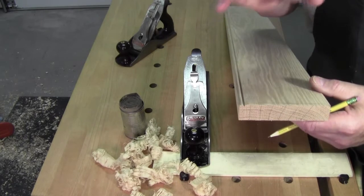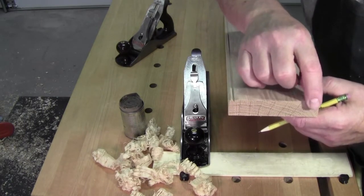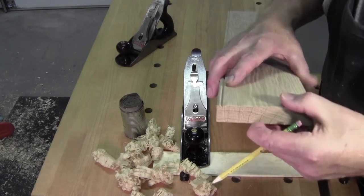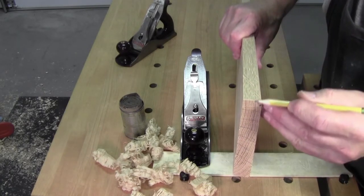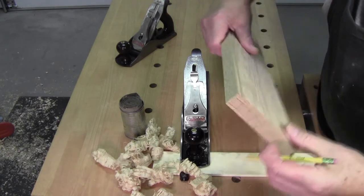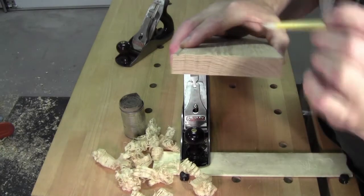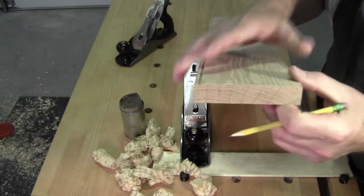But red oak and white oak differ in their cell structure. I planed the end grain here, and as you've heard me speak in the past about quarter sawn wood having the growth rings 90 degrees to the face — so this face will be quarter sawn. This is flat sawn. This is the inside of the tree, this is the outside. The further to the corner you get, the further towards sap wood we get.